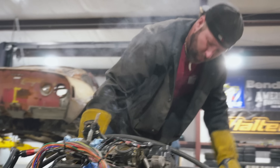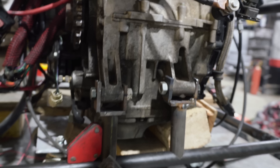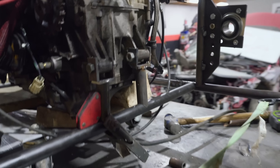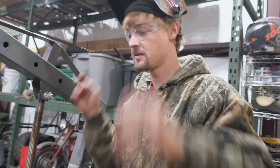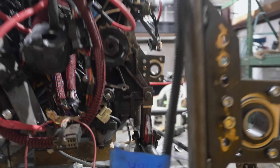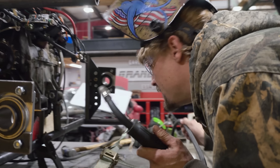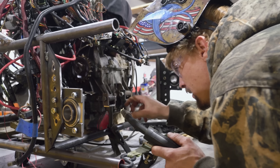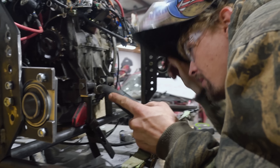Don't breathe that — let's open the door. We have our rear motor mounts mocked up. On first glance these look identical, but they are different heights and different in-out positions, so we have two separate motor mounts. It went from 'this is going to be easy' to 'oh man.' So now I'm just going to tack this in place with the bolt through it and leave the bottom unwelded like before.